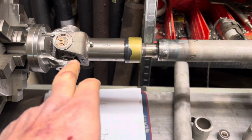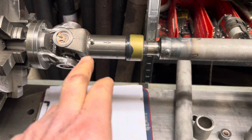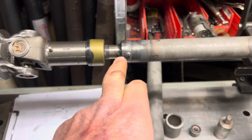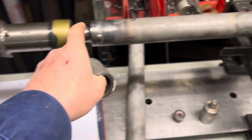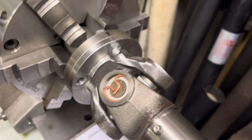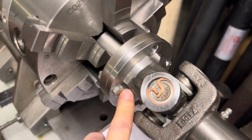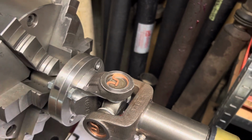That's a shorty 1 3/8-16 spline Neapco slip yoke that I had, for a PTO. It's a 1701 stub shaft with a lot of rework to get it to fit this tubing. It was made for 2-inch tube, and I reworked that substantially to get it to fit in there. This is a PTI blank flange that I made over, and I put those pockets in there, and there's the bolt circle that they needed, and the pilot's inside of here, obviously.